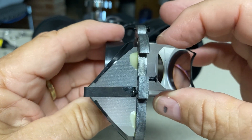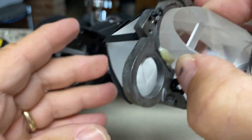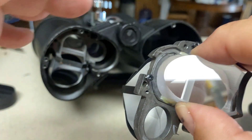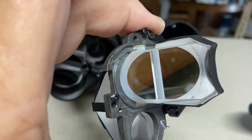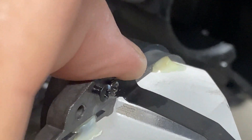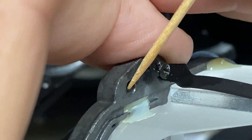What we have here is two optical prisms. One is mirrored — this one right here — and this one is not. Don't touch any of the optical surfaces. My whole reason for this video is to determine which screws are the collimation adjustment screws and which ones fasten the prism assembly down. The ones that fasten the assembly down are already removed, so all that's left are the collimation screws. They're the screws that sit up — those are the ones that adjust your collimation. The screws right next to them, flush with the mount, are the ones that fasten it down once you get it collimated.